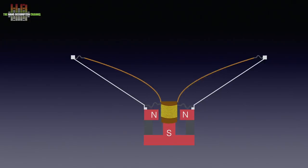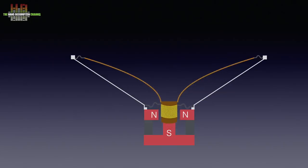There is an intended movement as a result of the current from the amplifier, while there also is an unintended movement due to storage of kinetic energy in the cone assembly. Mass in motion needs some time to halt again, especially at the resonance frequency of the loudspeaker.